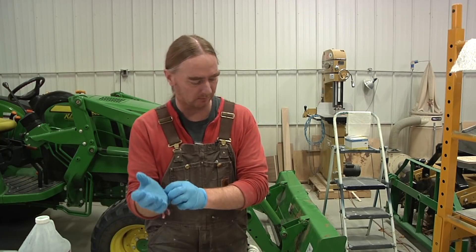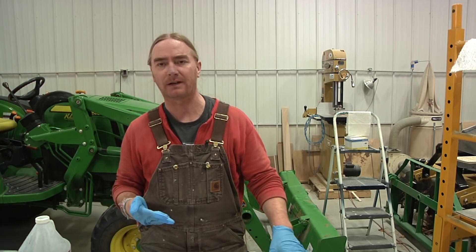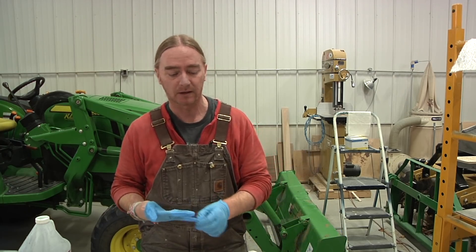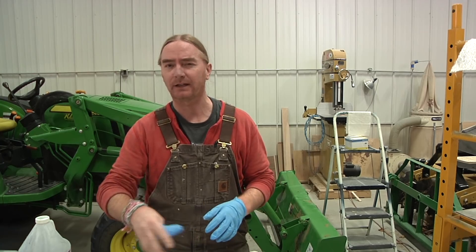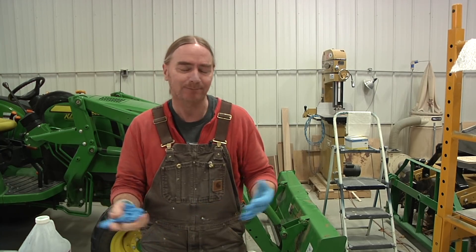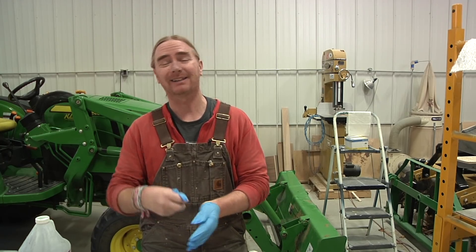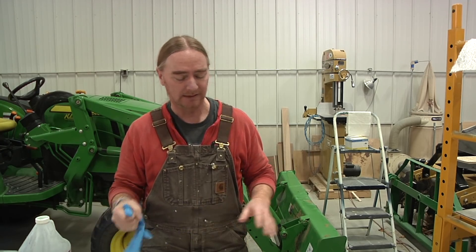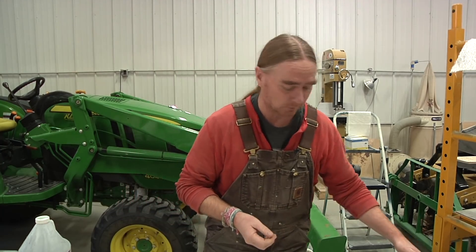Now we've got everything wetted out, so we just wait. Before I leave tonight, the 2-to-1 and 5-to-1 epoxies are fine — they'll cure overnight and be ready to go by morning. But for the polyester and the vinyl ester, I'll come back after the resin has set up and give it a light coat of PVA. Normally I'd topcoat with gel coat and then PVA, but that's when I'm actually finishing a surface. I don't want to add gel coat here because it'll create additional thickness and it's no longer an apples-to-apples comparison between the strips. So I'm going to walk away and let this stuff do its thing.